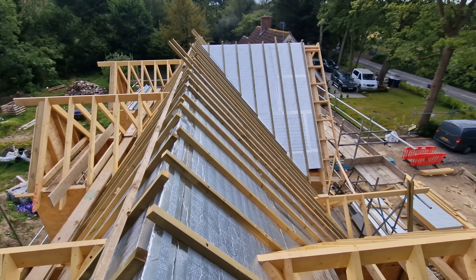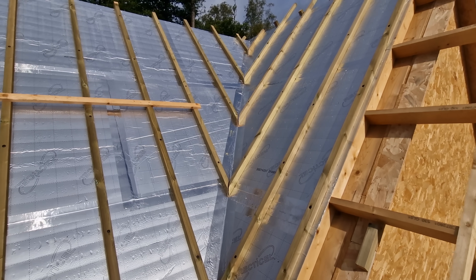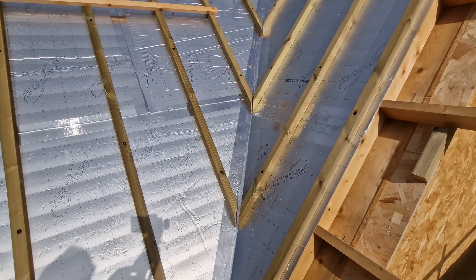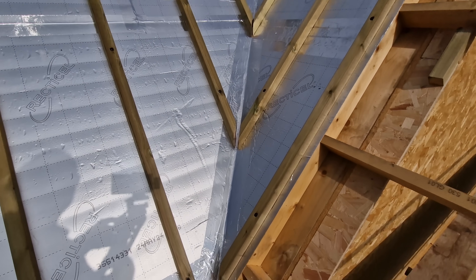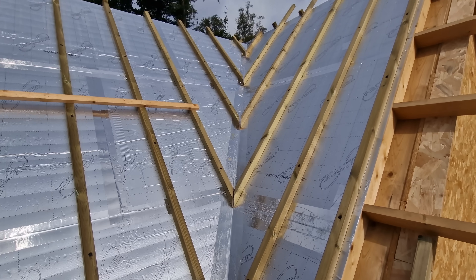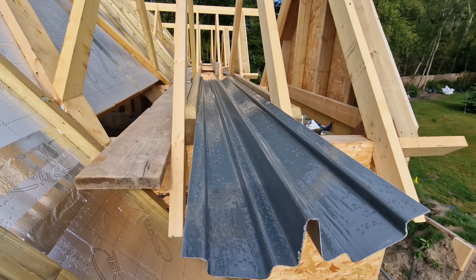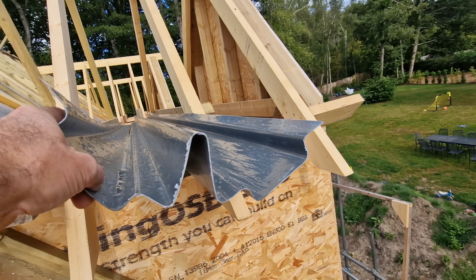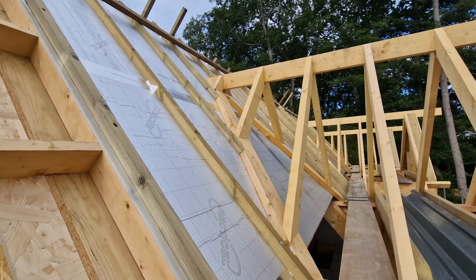It's a pretty impressive structure. On the main front section we PIR'd over both sides because this is the main mass of the roof. Over the valleys we miter the boards perfectly with a compound miter, put them in together, then tape over the top. The counter battens are left just short — purely so if we get any rain it won't soak up the ends of those timbers. The valleys we're using are fiberglass — we fix two battens all the way down and the valley sections clip in over the top. Tiles are dry cut into the sides, and this effectively acts as the drainage gutter.